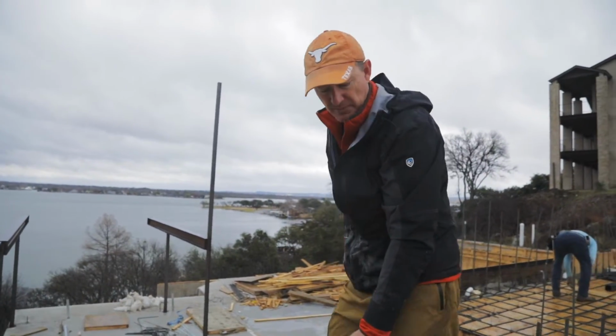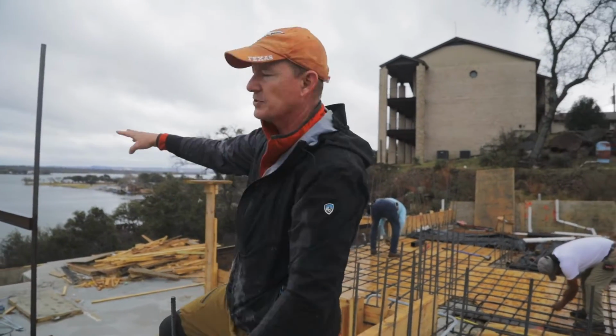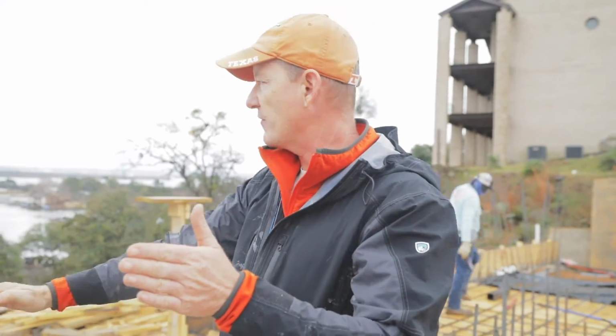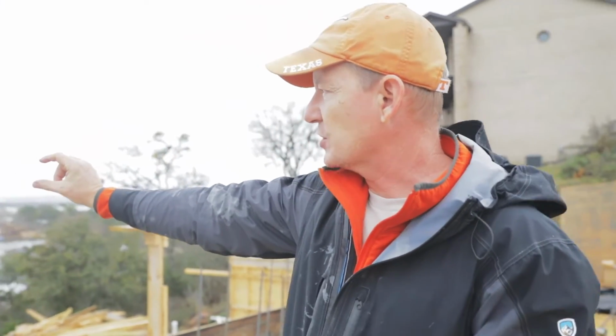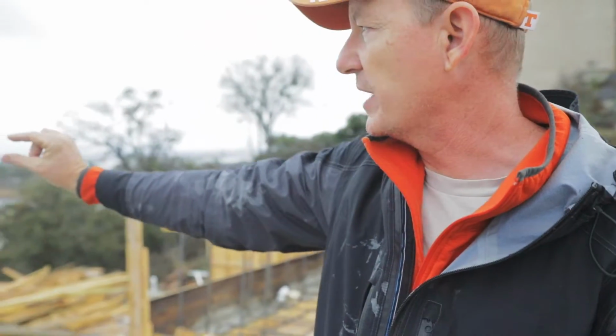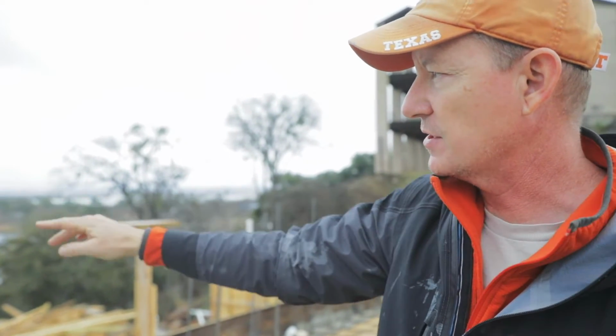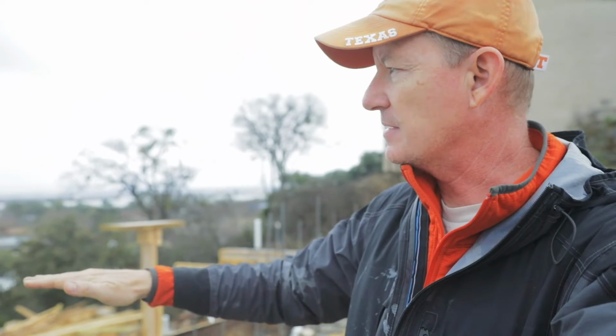But we even planned it in better, because those beams are part of the porch, and when rain comes on the porches, you want the water to shed away from the house. So those beams are sitting down. I planned it in an extra 3 inches below grade, so we're going to have to add 2 2x6s on top of those beams to raise it up inside the house.